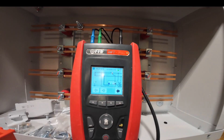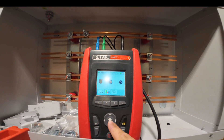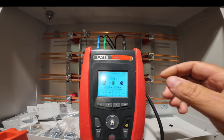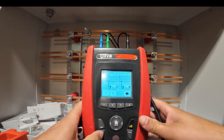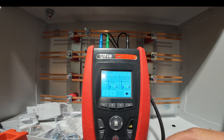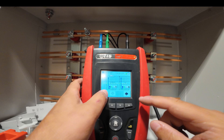If I bring you in closer to begin with, because I realise the screen doesn't always come over well in bright light. You can see we are in — if we go to the home screen and then we want to check a volt drop — it starts asking for voltage to be applied. With the TIS MFT Pro Plus you always have the help menu and that shows you how it wants to be connected. If you were doing a three-phase volt drop measurement it shows you what you need to do, and your single-phase one, with various screens and modes depending on what you're actually going to do.